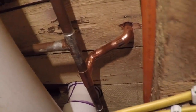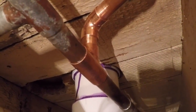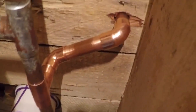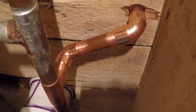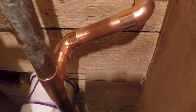Here's the plumbing for the toilet feed line. These lines have to be completely dry — if there's water in there you'll have a hard time soldering it. So this is just the dry fit; I need to pull that apart, flux everything up, put it all back together, and then solder it.